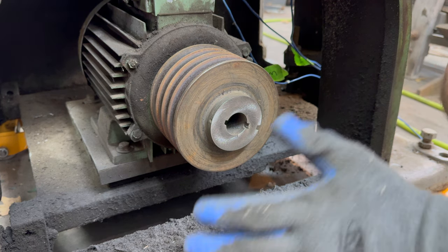This next part is kind of boring, so here are some facts and stats about the Monarch Model W 16-inch helical geared 16-speed Timkenized lathe. This lathe has a 30-inch long bed and an 18.5-inch swing. The listed weight without motor is 4,650 pounds. The hole through spindle is 1 9/16 inches. The center Morse taper is a number 4.